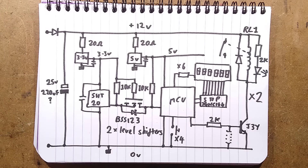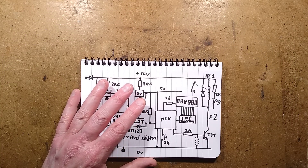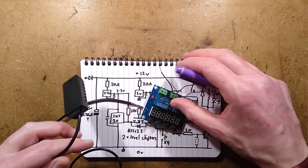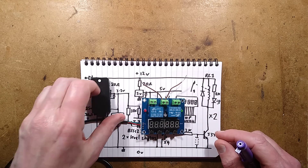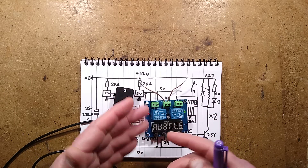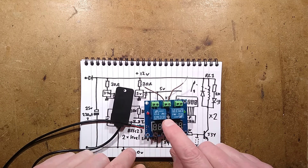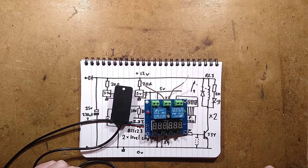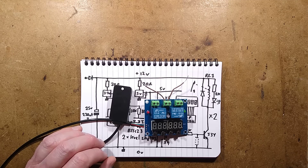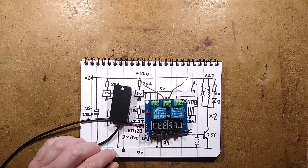And that is it — a fairly straightforward circuit. I will include the full instructions for programming this in the description below, because these modules are very good but they never seem to have programming data online. It's very neat and functional. I like the fact it can be configured to run a heater, air conditioner, humidifier, or dehumidifier just by the difference between the start and stop temperatures or humidity values. The M452 humidity control module — head down to the description for any data I've forgotten and the full programming instructions.